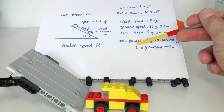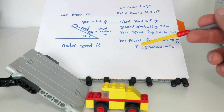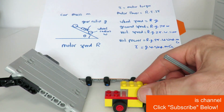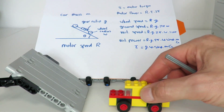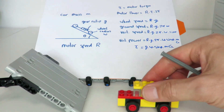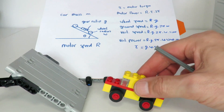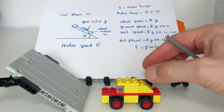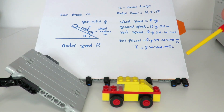This is the additional torque required to overcome the vertical ramp — additional to the torque already needed just for normal horizontal driving of the car, which accounts for all the frictions in the gearbox. As you increase loading, frictional losses also increase proportionally, so this is something that has to be measured rather than calculated.